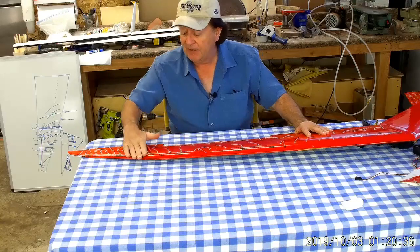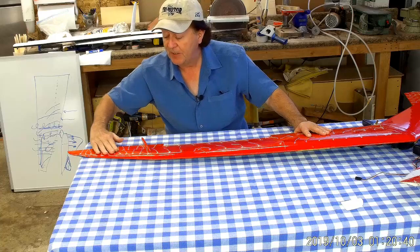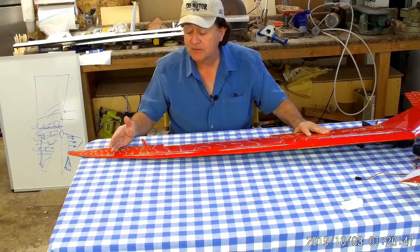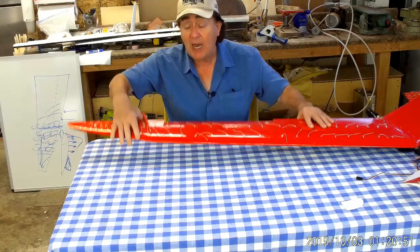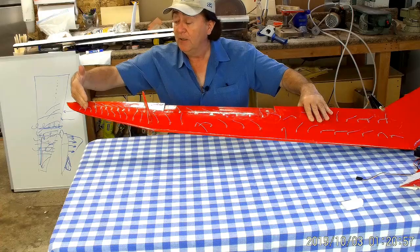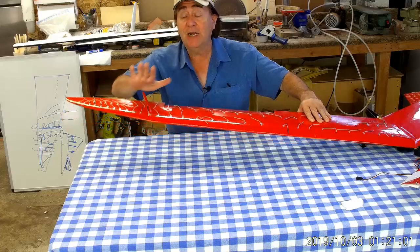Out at the tips they're straight — they're doing good, everything's working, going straight. In fact these are straight here too. But then little by little the spanwise flow builds up out at the tip, and we begin pushing that flow off the tip and the tip stalls — because this high amount of taper causes that spanwise flow to reform before you get out to the end of the wing.